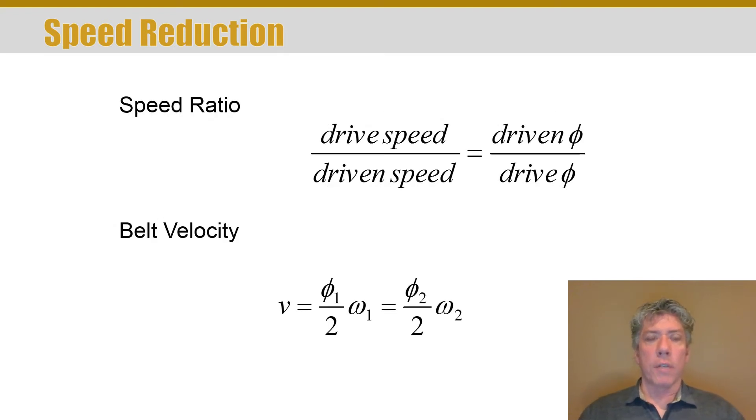How do we quantify speed reduction? It's the drive speed over the driven speed. In most cases, the speed ratio is greater than 1, meaning the thing doing the driving — whether an engine or a motor — is usually moving faster than the desired output. On a bicycle, the speed ratio is actually less than 1 because the drive speed is lower than the driven speed — the back wheel rotates at a higher RPM than the pedals. But in most machines, a motor has good speed but not good torque, so you run it through some type of gear or belt-chain reduction to reduce the speed to what you want.